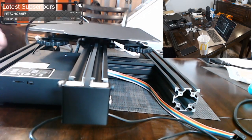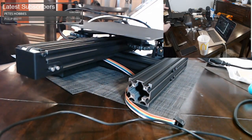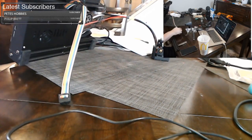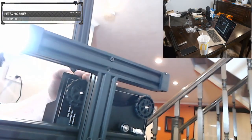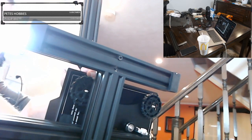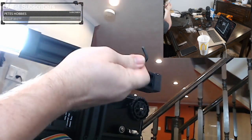So for our first extrusion, let's rotate this a little bit. Again, you want that nicked outside forward, because this is the front of the machine. Let's rotate it like this. And let's get a screw in the bottom and start it. So you can see where it goes right underneath there. Here, let me make sure your camera is on it. So it goes right in here. And we want to just go ahead and push one through. Where's my wrench? If I don't have a wrench, I can't do this, right? So this is a 4mm Allen wrench. Very helpful to have one of your own. The machine does come with it, but I like to have slightly better tools than the freebies.